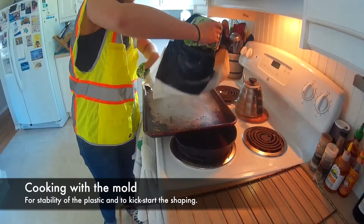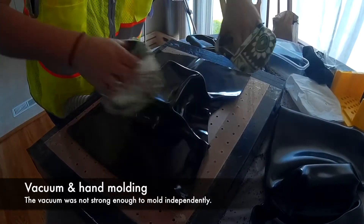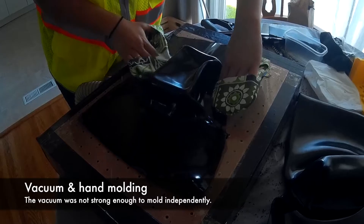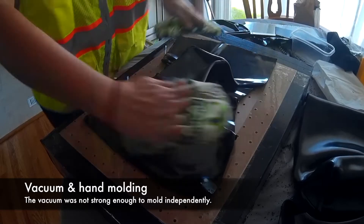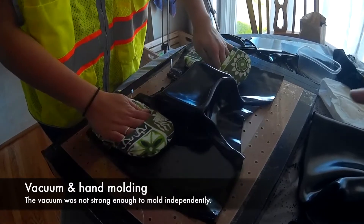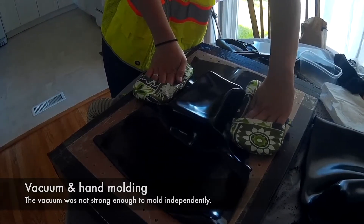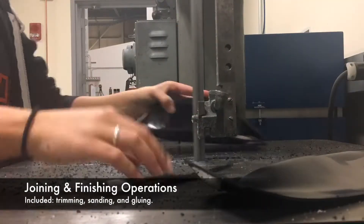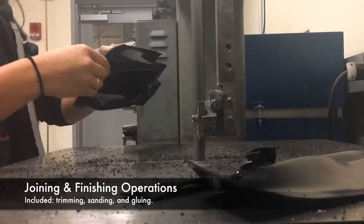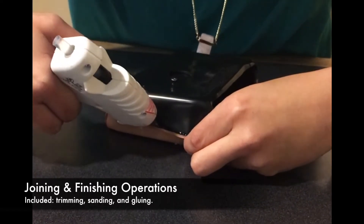As you can see, the mold was so hot from being placed in the oven that it began to collapse with the ABS, creating a bit of a concave shape. I followed the play button YouTube video shown in class to build my vacuum molder out of pegboard, MDF board, and airtight duct tape. Although this created an airtight device, the shop vac I used should have been much stronger. All in all, the mold created a usable shape that had some serious trimming to do next. After vacuum molding, I first trimmed the excess plastic with the vertical bandsaw and then with an exacto knife around the rounded edges.